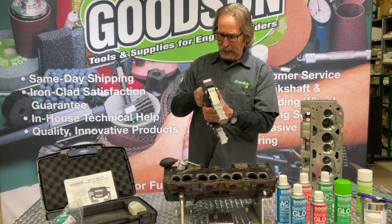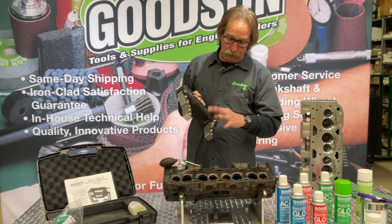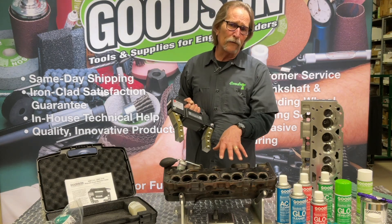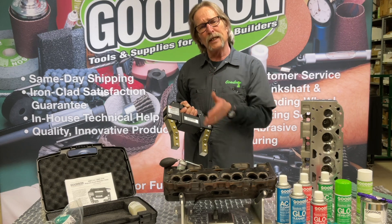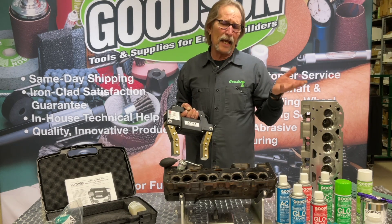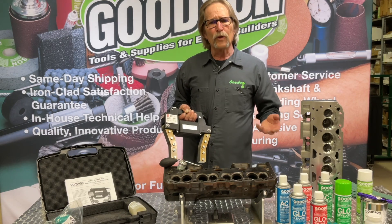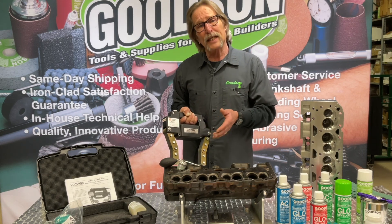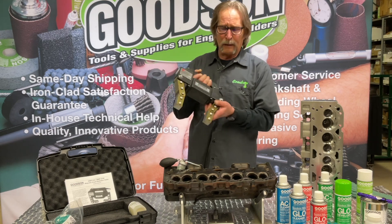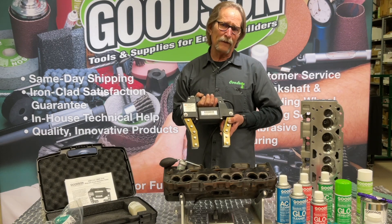What I really like about this is: one, it's very heavy duty. Two, it has articulating legs that I can move around and conform to whatever irregular surface is on the workpiece when I'm trying to go looking for those cracks. Over time, certain applications have certain areas more prone to cracking than others — that's just something you learn with time. This is available at 110 volts, or we can export these as a 220-volt unit.